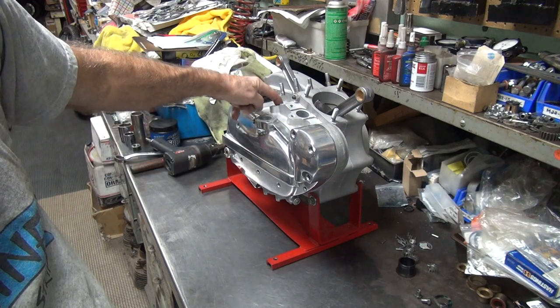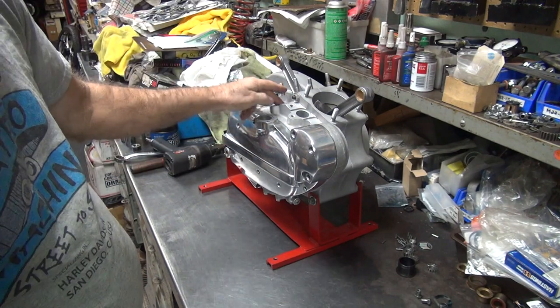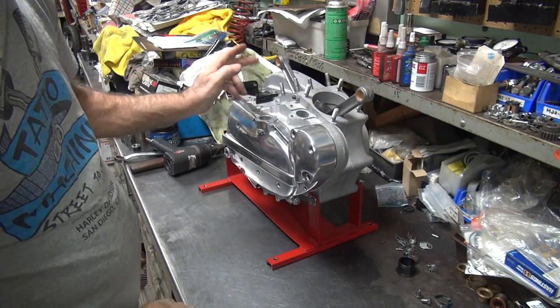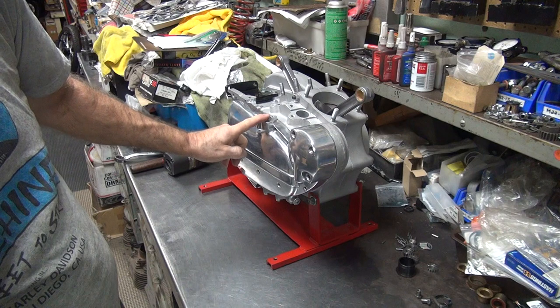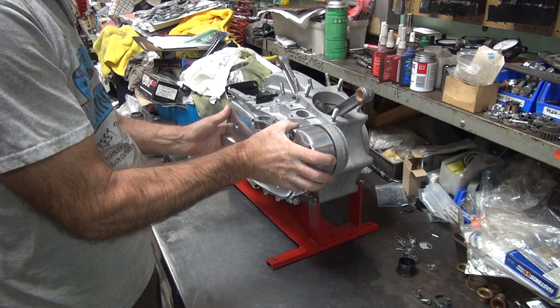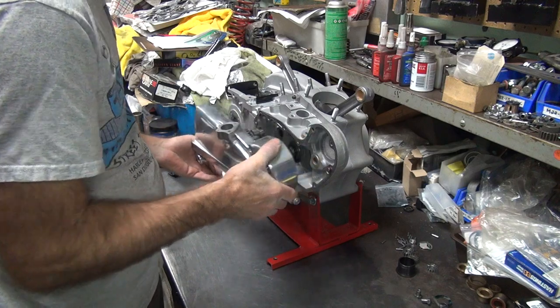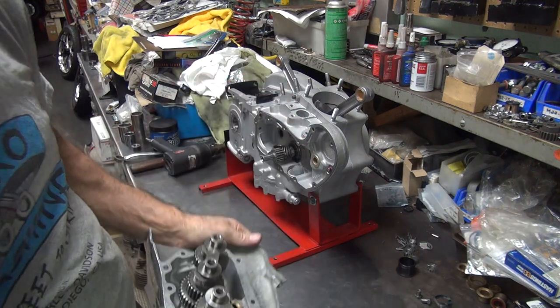This one's probably more down around 5 right now, but that's because one of the washers has a little cup shape to it, so it's probably more like 8 — but who knows. You always want this one tighter because that's when it works as a circuit breaker, if I use the correct terminology. That comes out nice and free. I like that.